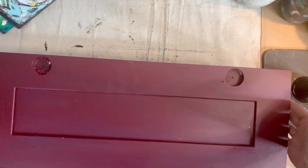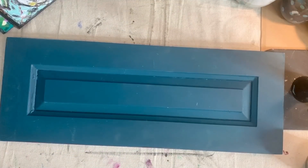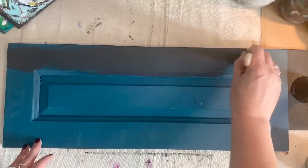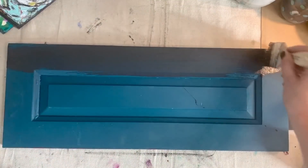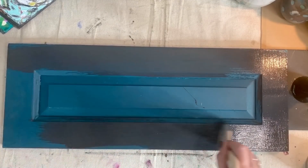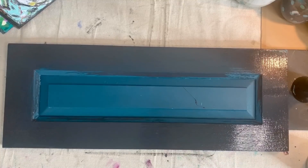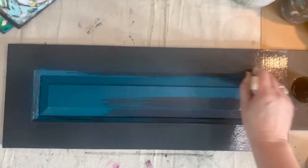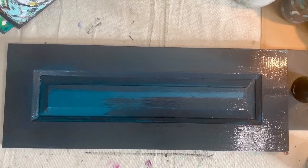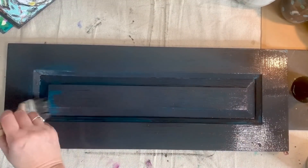By the way, on the other side we also have our Sugar Plum, one of our newest colors. So which should we glaze? I'm gonna grab a brush, put it into my black glaze, and swipe it all over. When you swipe glaze, it's important that you swipe it on in the same direction that you paint it. The reason why is because it will give you much more of a professional finish versus constantly painting in opposite directions. That's a really, really good tip. You don't need a whole lot of glaze, but just get it completely covered whether this is a piece of decor or a cabinet door or anything like that.